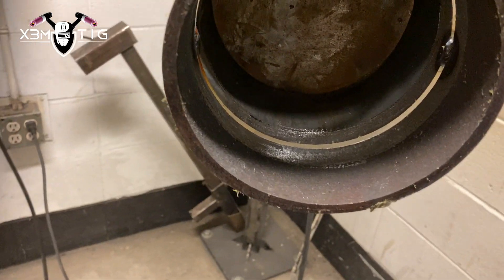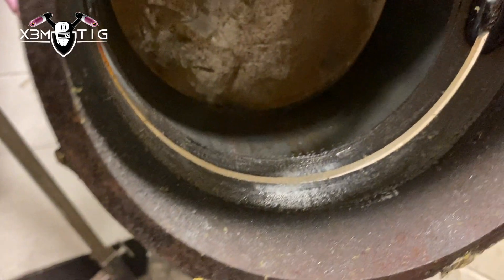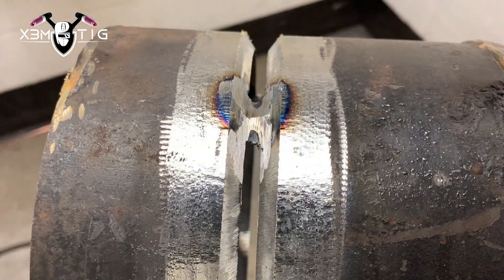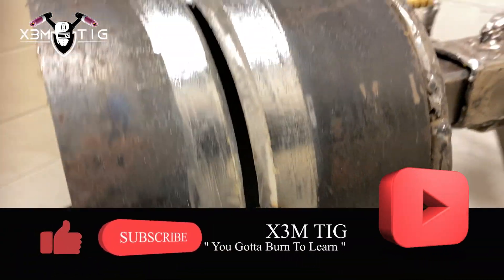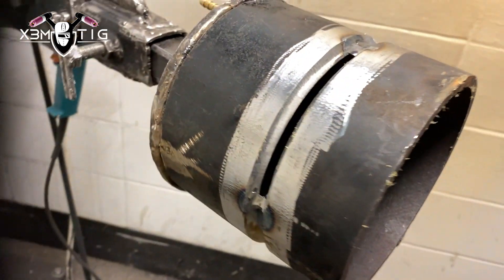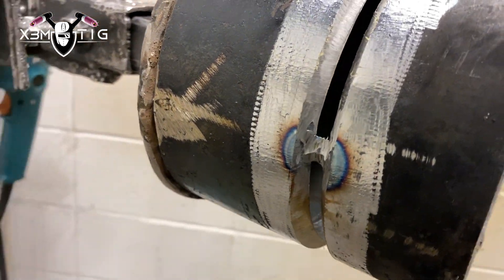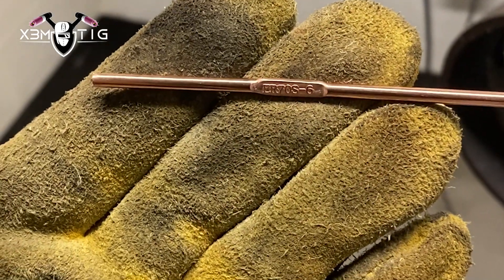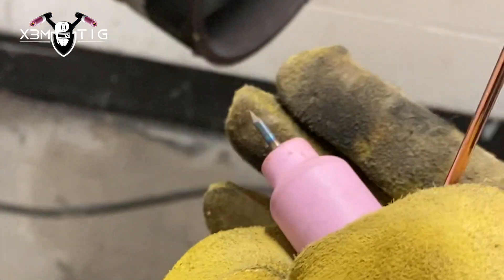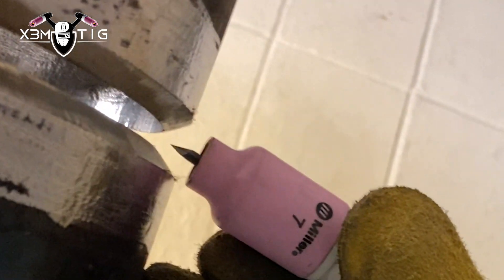For this video I'm going to show you the back feed technique — that's a front line and back line technique. Usually the back feed technique is used on the bottom quarter of the pipe, especially in the field. We're using ER70S6 1/8 TIG filler wire. Stick out is usually around 10mm, and we're going to do this freehand.